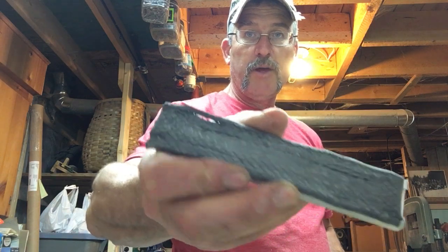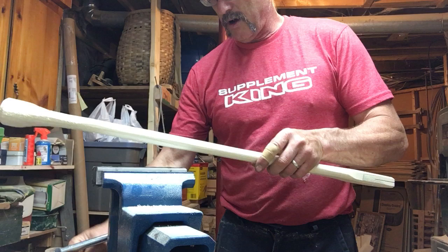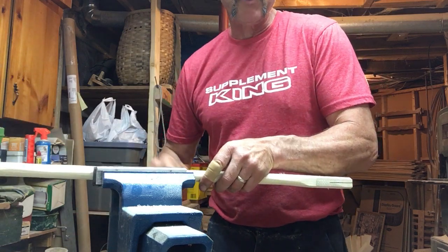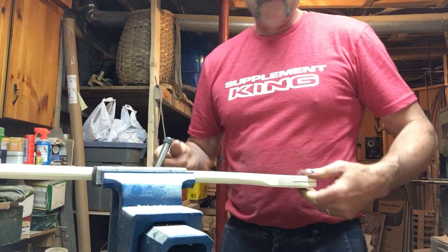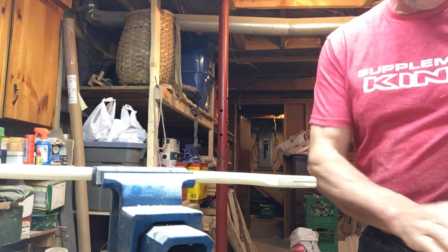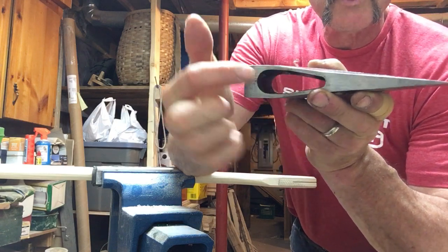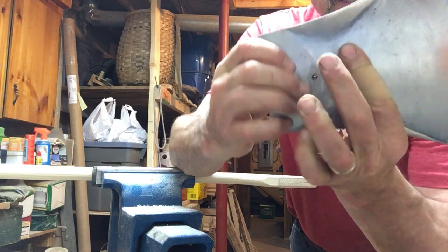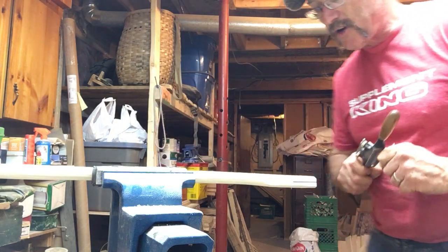It's a pretty big eye with a gradual slope down to the front of the handle. I'm going to take my spoke shave and start doing that on this handle. I'm going to start removing wood right here because I want that to slope up to the back of the handle. I'll take wood off both sides, counting strokes on each side and flipping the handle, because in order to get this to hang straight you need to take the same amount of wood off both sides.